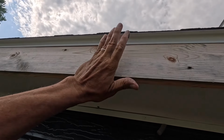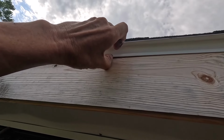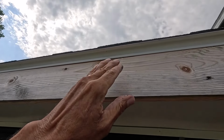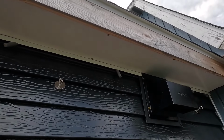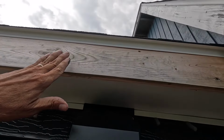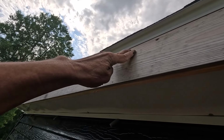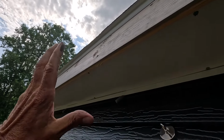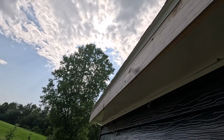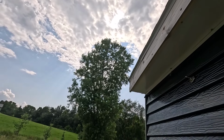And I have the fascia piece, and that slides behind this drip edge. It slides up, caps this, and goes behind there. And that is siliconed in place as well. I'll just be putting some silicone on here, nice and thin up at the top and under here. And we'll slide that up underneath there and clamp it in place until it dries. And that'll do it.